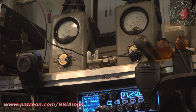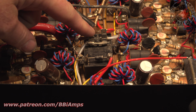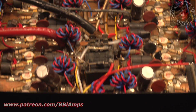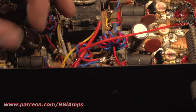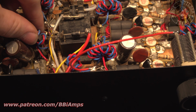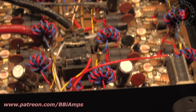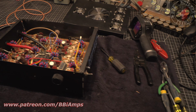That tells me there's not enough inductor down here, specifically here, between here and this splitter right here. Now, this box is getting hot, and there's something right in here that's out of balance. We've got to go hunt that down yet. But the point is, with this input variable in play, now the input SWR is tunable.